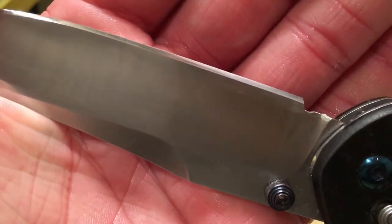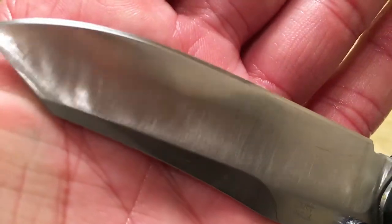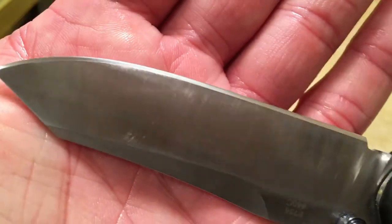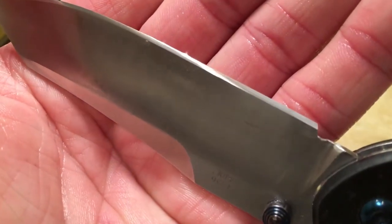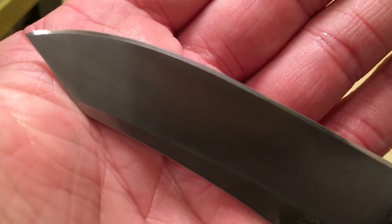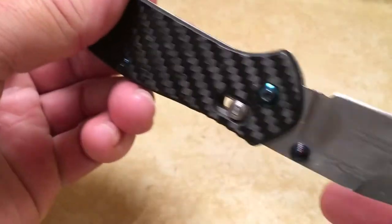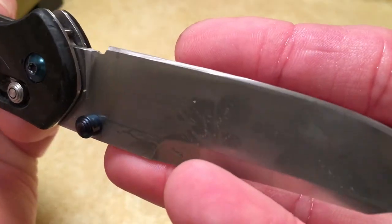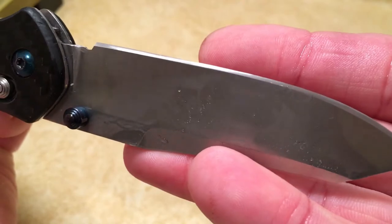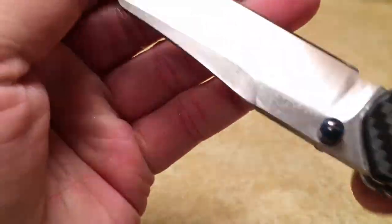and as pretty as we can make it off of this stone. So we just ran this knife across the stone 10 times. And this is our scratch pattern. It is starting to shine up, and it's starting to remove those 2000 grit scratches. Again, this is where the 2000 grit looks. And this is our 4000 grit.